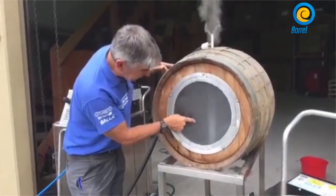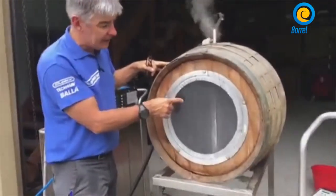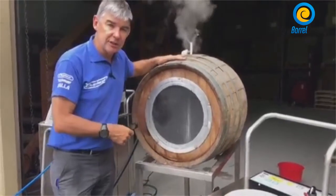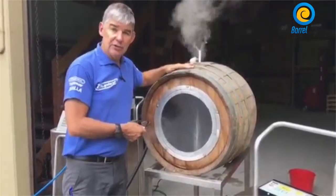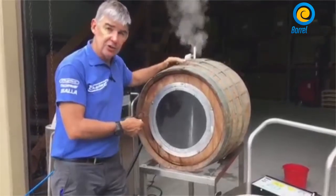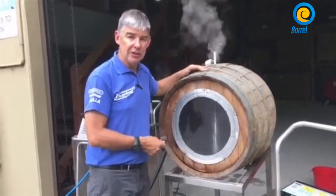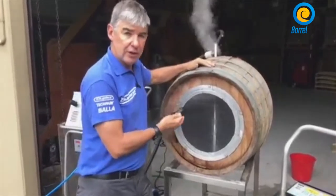Now you can see the diffuser inside the machine — it's not cloudy anymore. With one of the three phase machines, a wine barrel will heat up to 100 degrees in about four minutes. That kills brettanomyces and also starts to hydrate the barrel. All of our machines run at 165 or 180 degrees — it's a dry steam vapor. The higher the heat, the quicker the process.